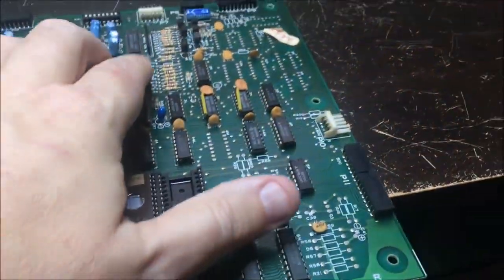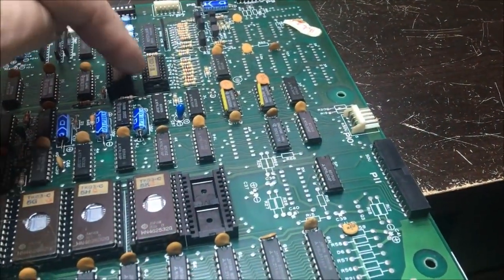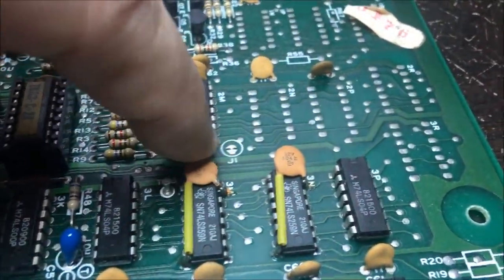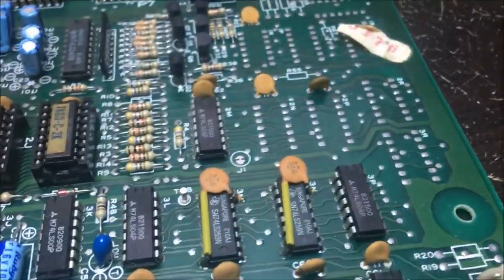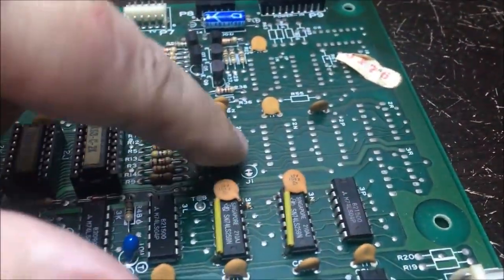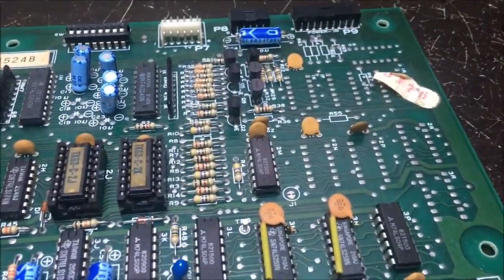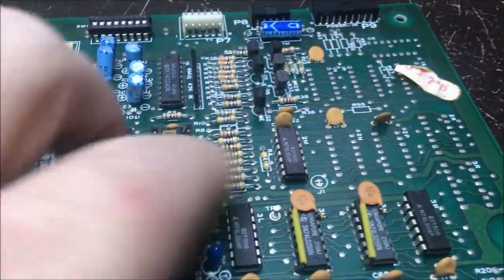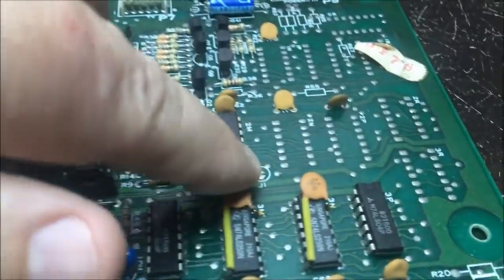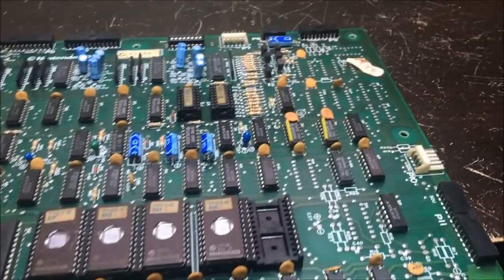What I'm going to do is invert the data that's in the PROM chips. And then there's this little jumper right here that you have to scratch because that's the background. If you don't scratch that, the background will be all white. And you scratch that off, it'll go to black. So to undo that, of course, you put the regular PROMs back in and then you just jump that. And then it'll be back to normal. So it's no big deal.